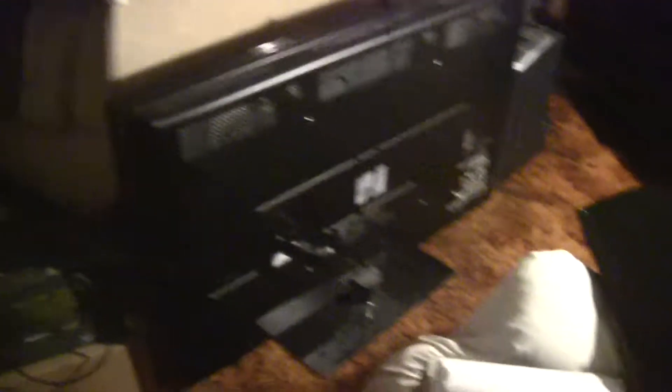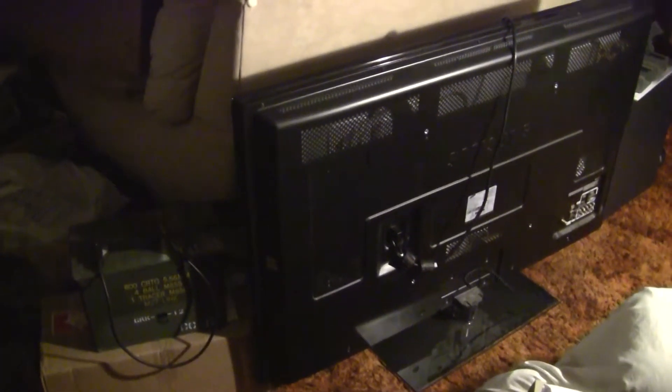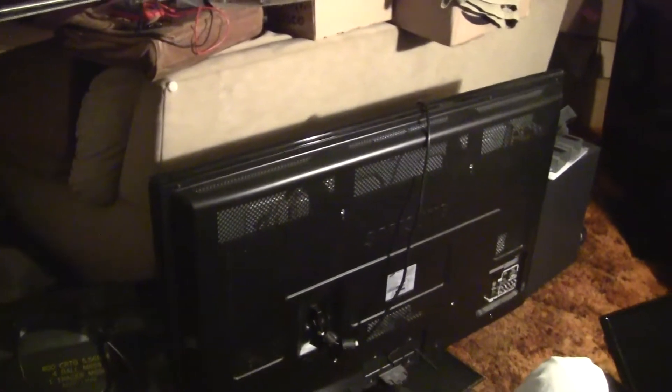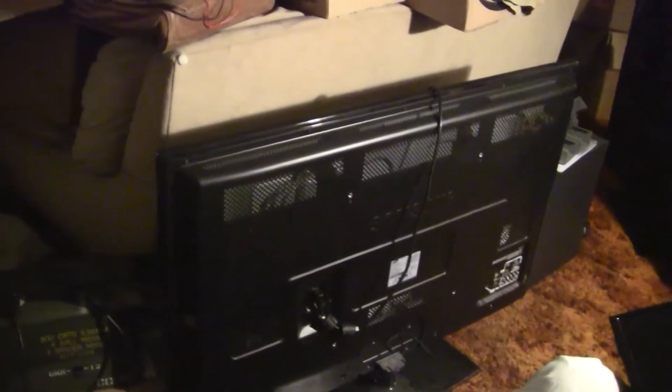I've got to look into this a little more — if that's going to need to be like a 12 volt system. I don't know if a 5 volt system is going to be able to do the larger screen, but I'll probably need a 12 volt video adapter and more power. I have to consider the current with the proposed TV going in, the computer, and additional devices. I'm thinking some kind of steel box noise filter and surge suppressor that I can probably screw right on the back — I don't want to get too carried away with weight. But compared to older plasmas, those things are really heavy, so it probably won't be that heavy even.